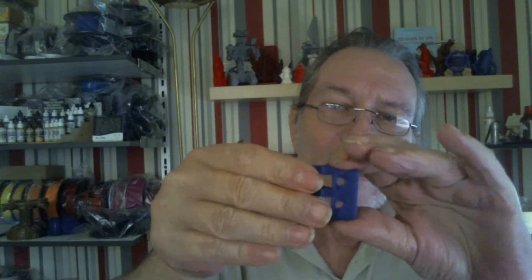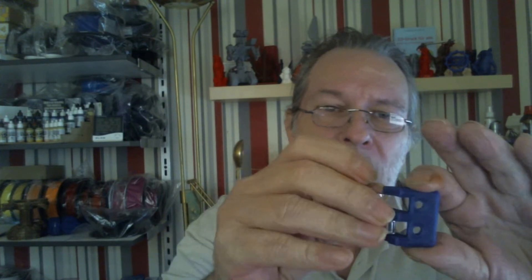It is hard to get them in there, but you can put them in and they will stay until you get the screw through. I'm going to have to use some brute force. But then it looks like this — you have one here, and the other one here. With your two M5 screws and hammer nuts, that will be mounted in the corner for your GT2 belts.